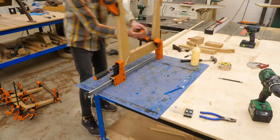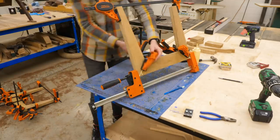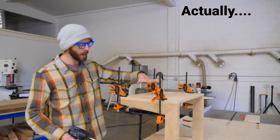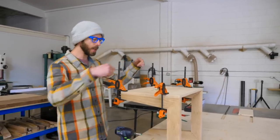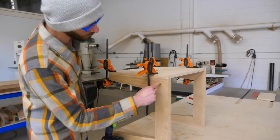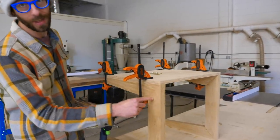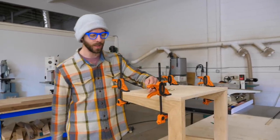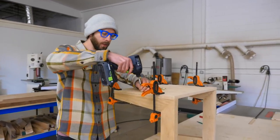And then instead of building an elaborate panel, I just pocket holed and attached a piece of plywood. So we're just gonna screw the panel on top because we don't wanna test the attachment this way so we know that this can't fail. I'm also gonna make sure I don't drive any screws that connect to that miter because I want this to be as clean of a test as possible. And because I like to live on the edge, I'm not even gonna pre-drill.